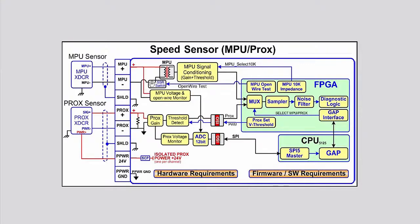The next type of signal is a speed signal. Each channel on the controller is isolated from each other and may be configured for either magnetic pickup units or MPUs, which serve as a passive signal, or proximity sensors, which serve as an active signal. A dedicated and isolated proximity power positive 24 volts is provided on each channel for proximity sensor use.